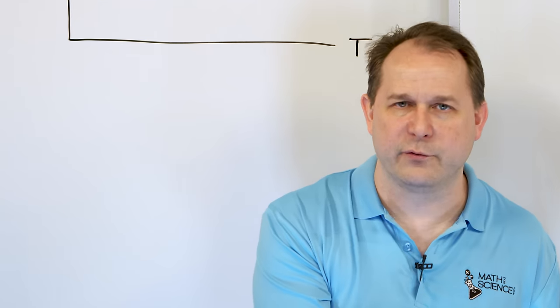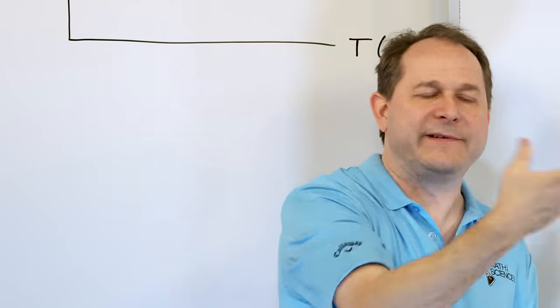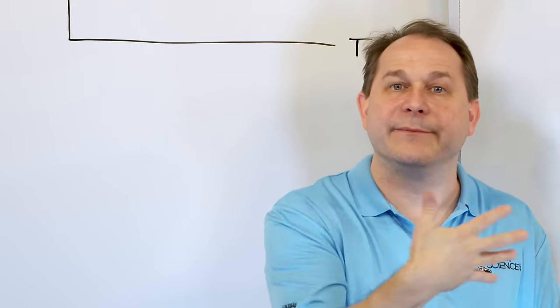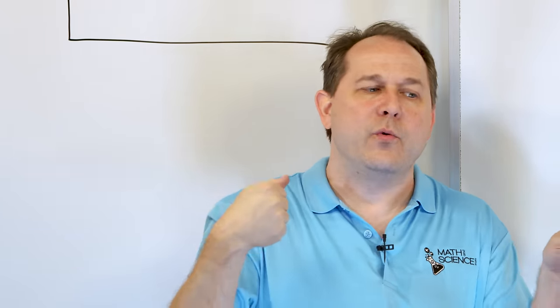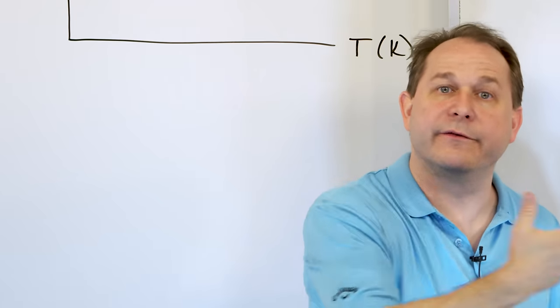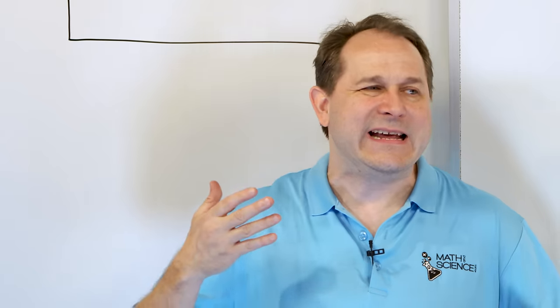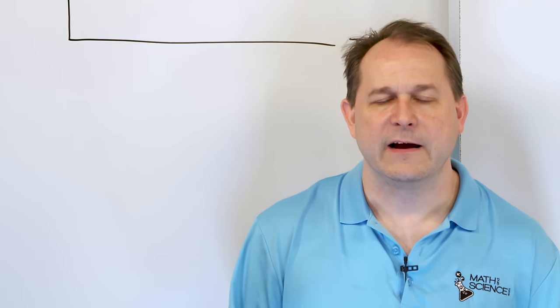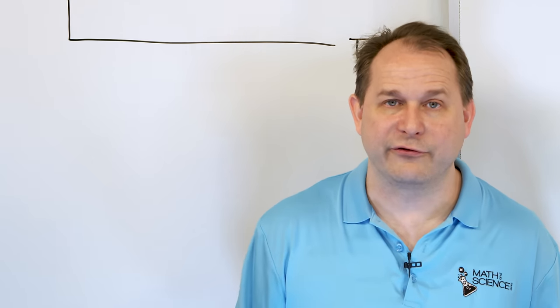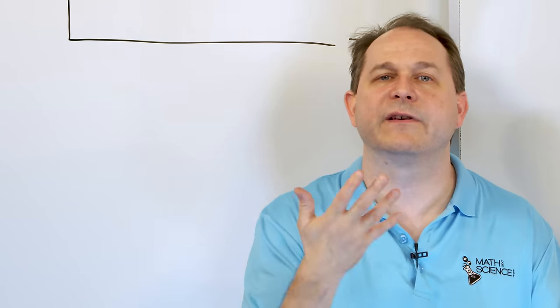When you shove electrons through a wire, those electrons jump from atom to atom. And as they jump from atom to atom, they collide with other atoms that are in the way. And when they do those collisions, they lose a little energy. So we can use a battery to keep the electrons moving, but there's constant collisions. That shows up in resistance. In any electric circuit, we say there's resistance. We try to push the current. We can overcome the resistance with a battery or some other voltage source, but there's an inherent resistance to pushing electrons through a wire because of collisions.